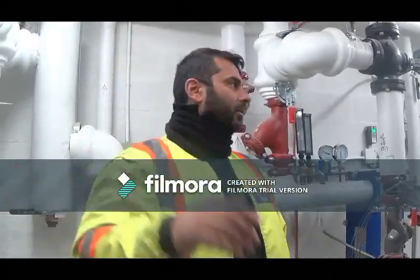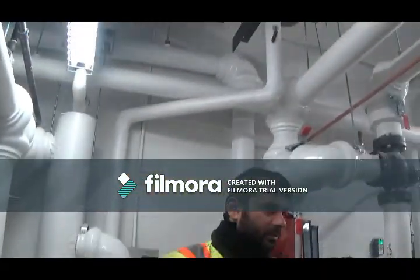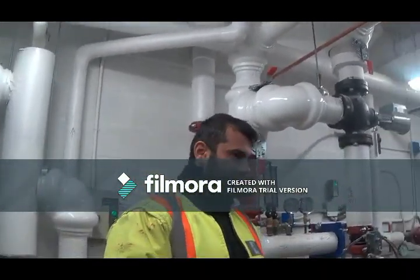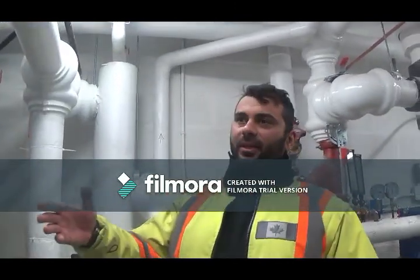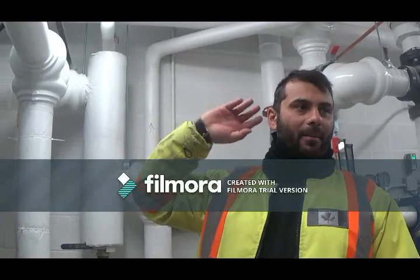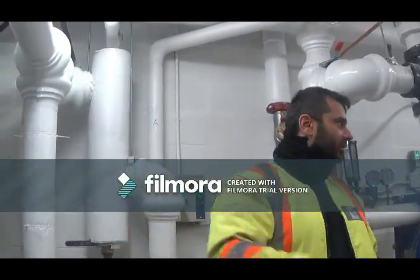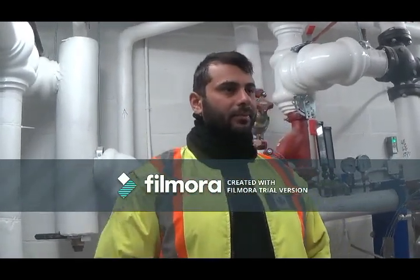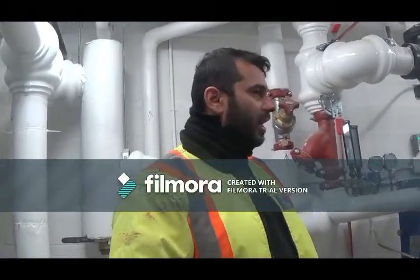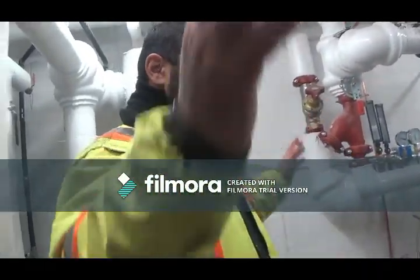So the way this building works is that the primary heating heats the domestic water. It's kind of like an energy saving. Primary heating flows through the turbo tanks, basically like heat exchangers, and flows back up. The domestic water flows through the turbo tanks and feeds the hot water into the building, the potable water. This is a lot of Tridel, Nova Trend, this is what they use now. Those big red tanks.